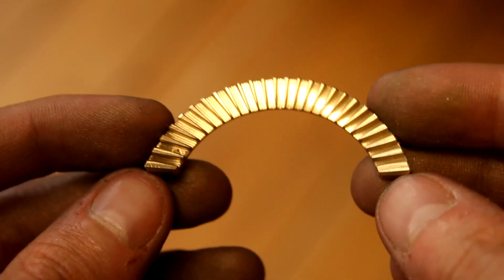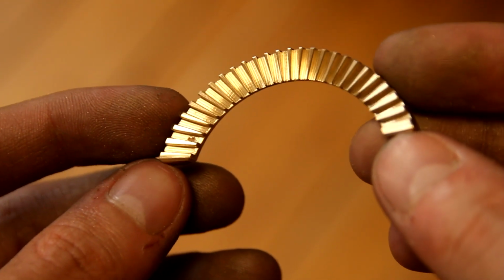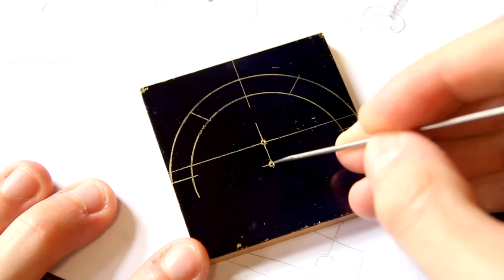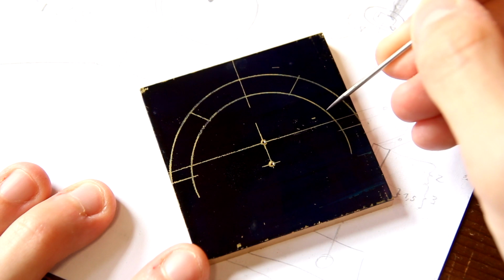Next up was the most challenging part I machined so far, the outer resting plate for the type levers. It's an inner cone with slits for each key stamp, but the slits have to be angled outwards to each side. It's really hard to describe, but after giving it a lot of thought, I figured out how I could manufacture this piece, simply by using two centers of rotation for different working steps.